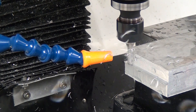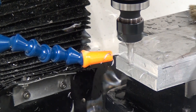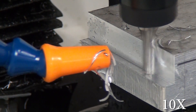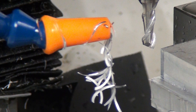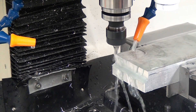On the next cut we're doing a 30% stepover, which is seventy-five thousandths. We slow the feed way down to 5.5 inches per minute, again at 2100 RPM with a half inch depth, and the finish comes out quite a bit smoother. The reason I stop at 30% — from what I've been reading online — you want to do all your cuts between 0–30% or 70–100% stepover. You want to stay away from the 30–70% range, as you're getting towards the middle of the end mill.